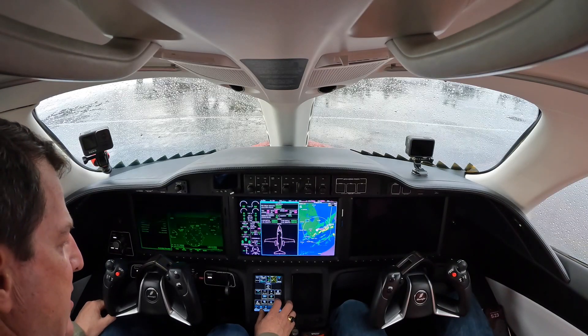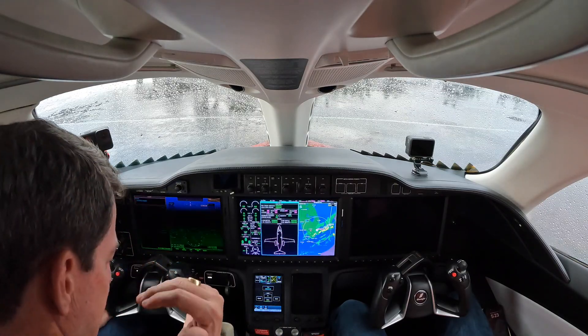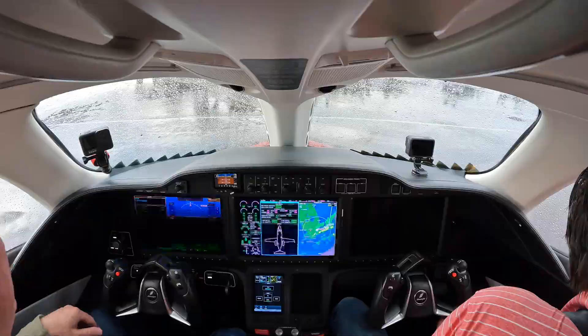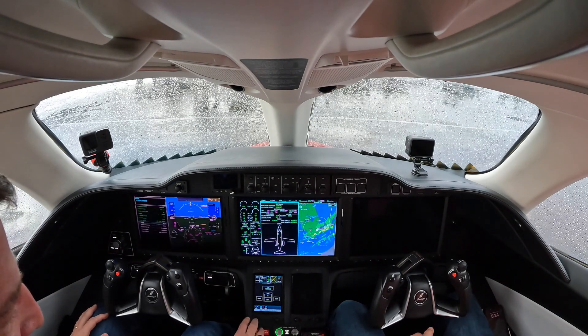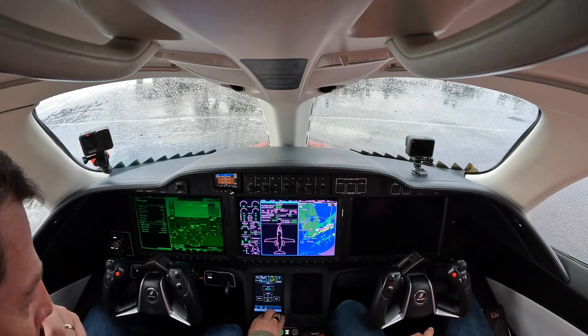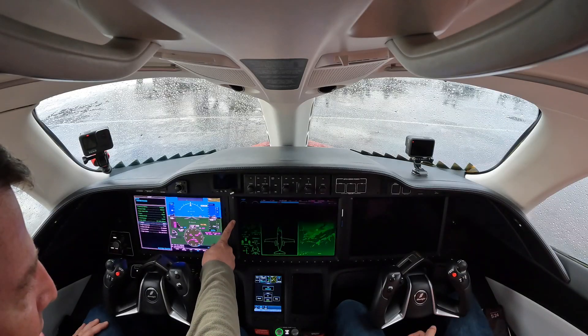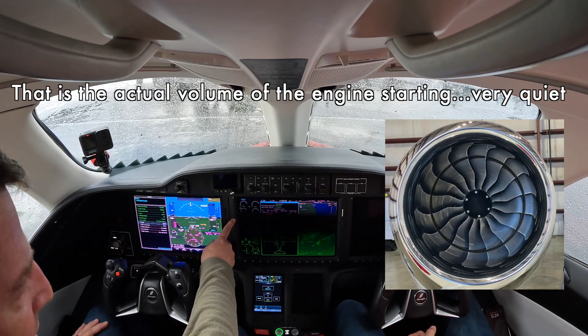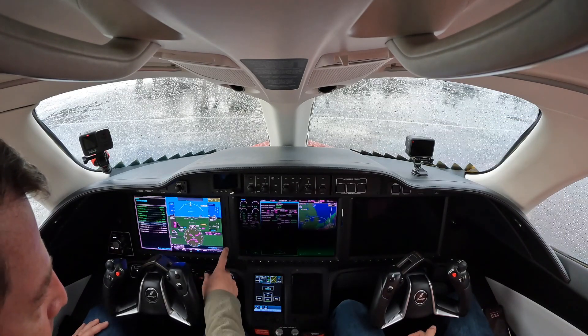Today is the 15th — it's an odd day, so I'm going to start with the odd engine: number one. I go to the timer, put 32 seconds in there because I'm not fast enough. I'm looking left at the engine, right and ahead — it looks clear. Looking with the idle, the left — it's illuminated, it's idle. That introduces the FADEC. I've got a start light, I've got N1 rise within 15 seconds. I've got N2, oil PSI, oil temp, and fuel flow. We've got a starter dropout — we've got a good start on number one.